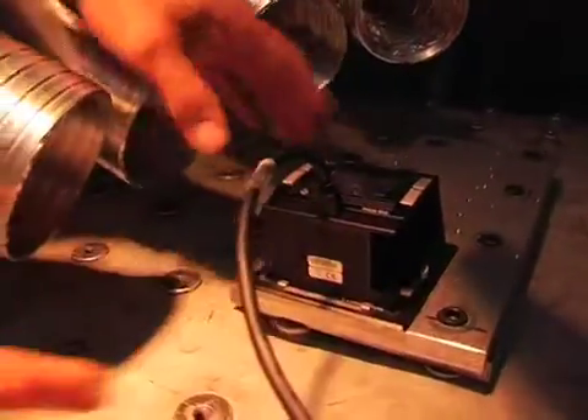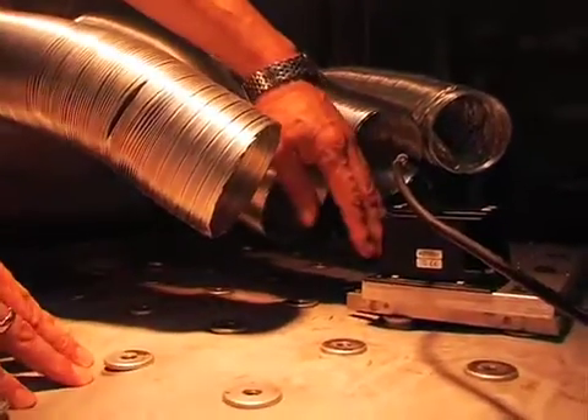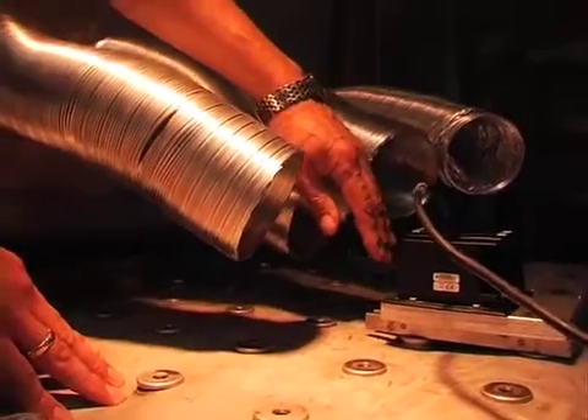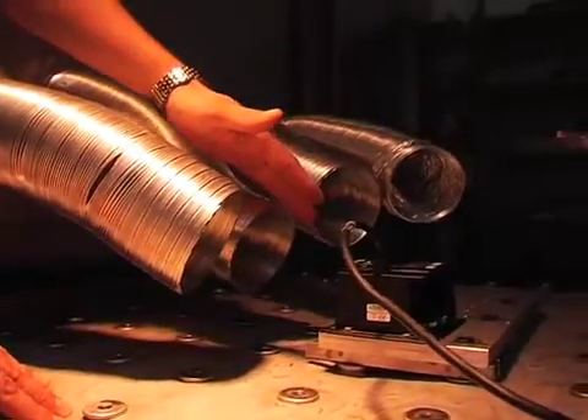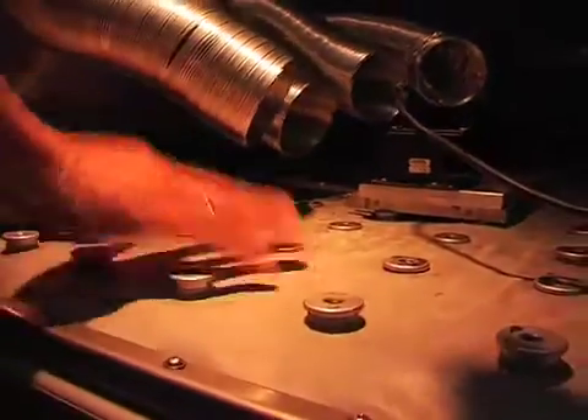Click it on here — this chamber is a combination of an oven, so I can get hot air out here at 200 degrees Celsius, or I can get cold air at minus 100 degrees Celsius, or I can make this whole thing rattle and shake. This is my torture chamber, and I'm trying to do my best to destroy this piece of equipment in order to find the weak points before the customer does.